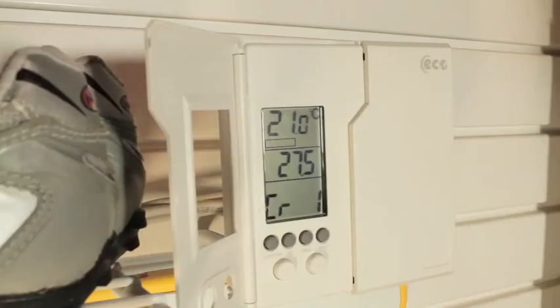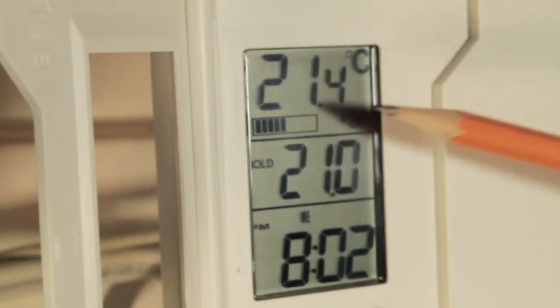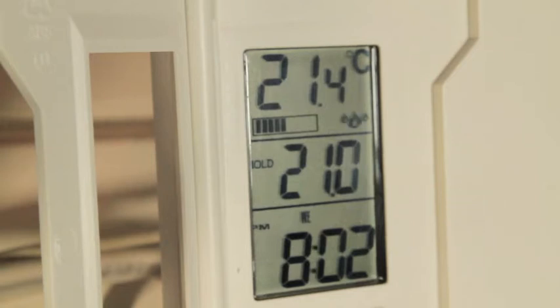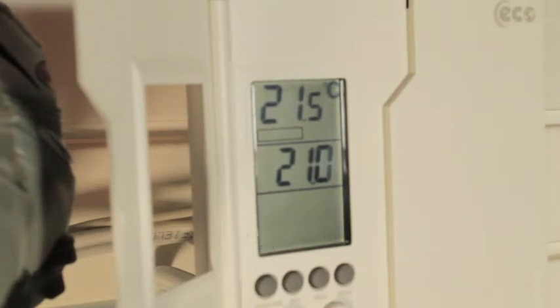The next option is the cycle rate. The default cycle rate appears as CR1, and this is a good setting for an electric baseboard heater. This rate allows the thermostat to send pulses of electricity to the baseboard to maintain a constant and efficient temperature in your home. When the thermostat is using heat cycling, you will notice the power output level will change, representing how much energy is being used. CR0 turns off heat cycling — the thermostat will wait for the temperature to drop half a degree Celsius or a full degree Fahrenheit before turning on the heat. We recommend this for fan assisted heaters.